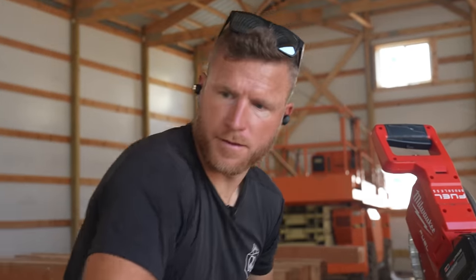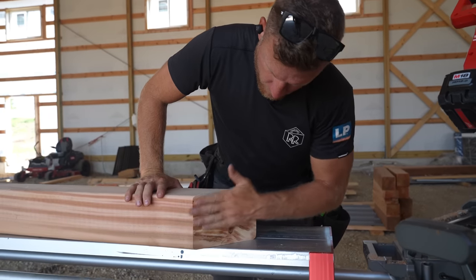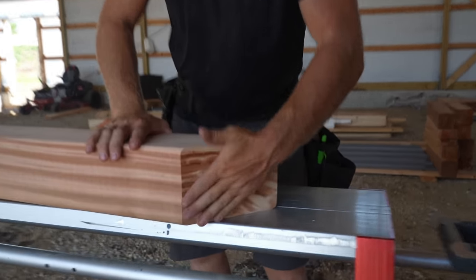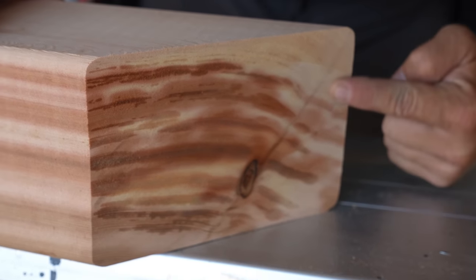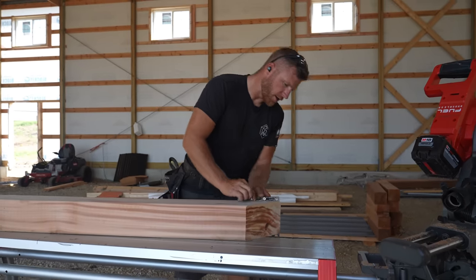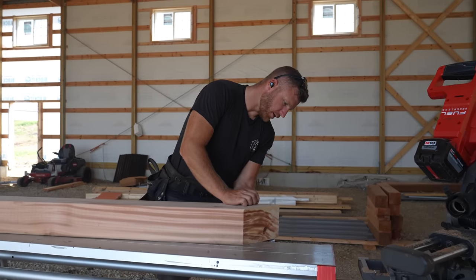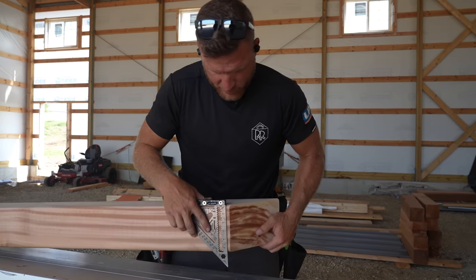Look at this — to me, that is good. It's almost like a one-piece. You can see my line here, but it's barely noticeable to your finger. So as long as the miter is good... which it's actually not as good as I would hope. We've got a little gap. My guess is when I cut the first one, something is not perfectly flat.